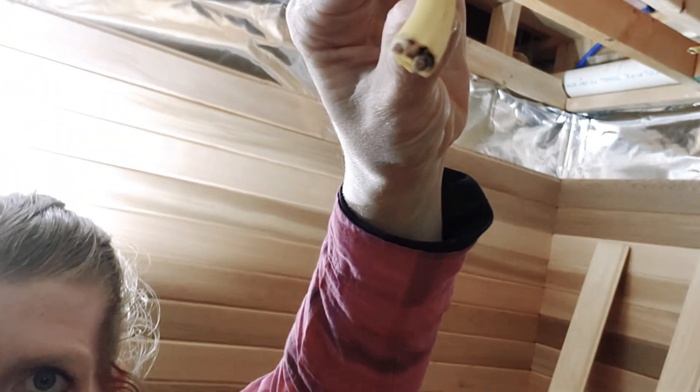I always crack up because Dean will come down and be like, are those hot? Fun fact: if they're hot, you cap them. You don't leave them like that. It's always safer to tape them no matter what, in case somebody turns a breaker back on they're not supposed to. Another way you can protect against that, fun fact, is to put a piece of tape over that specific breaker in the box, labeling it as staying off.